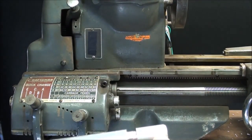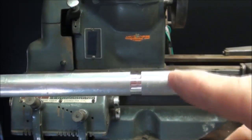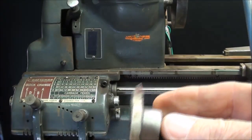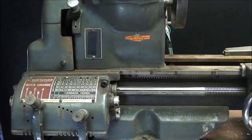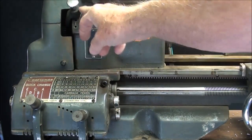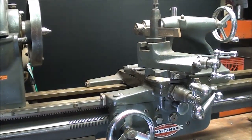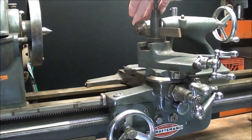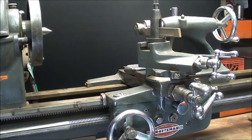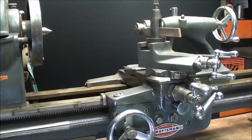Today I'm going to make a simple thread here, up to the undercut — and you do need an undercut, or some way to terminate your thread. This is just half-inch aluminum, and I'm going to cut a one-half inch 13 thread. I'm going to use an Armstrong form threading tool. The quick change gearbox is set for 13. The feed reverse lever is set in the top position, I'm in back gears, and I'm running at 70 RPM. The compound is set at 29 degrees. The threading tool holder is already set on center as far as elevation is concerned, and it's squared up with the work using my center gauge — my little fishtail. So that's all been done ahead of time.